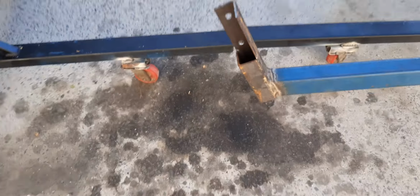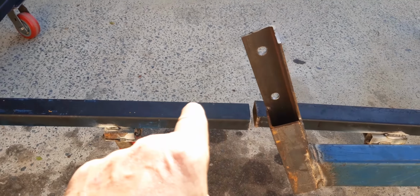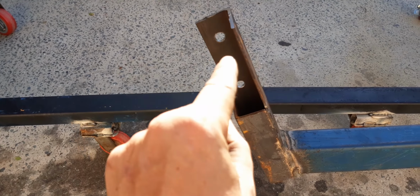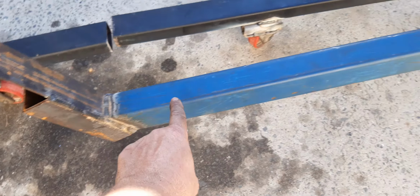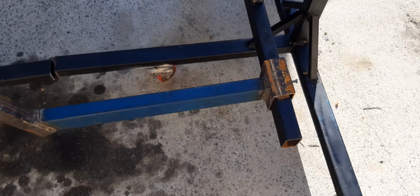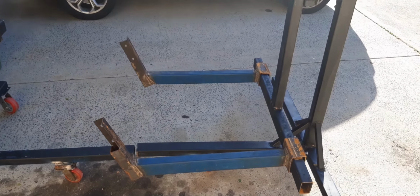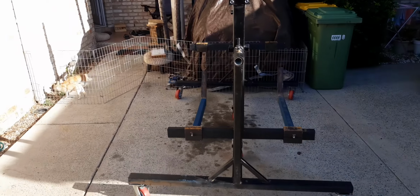So what it does is, the front beam on the bus, you can imagine there's 4 bolts. This is the front two, and that's fairly stout angle iron. I turned it into a box section here, and this is drilled out, and then this was cut on an angle, and then I measured out to the front of the bumper bar, and then I knew how far I could have this out. It looks fairly simple, but putting it into practice is a little bit different. So it looks pretty good though. It's starting to come together.